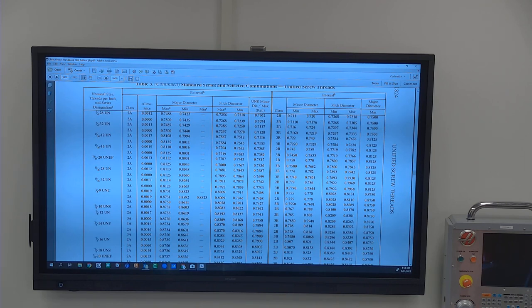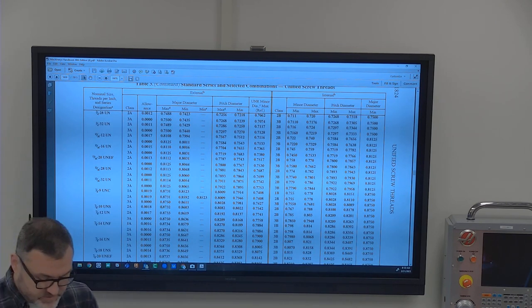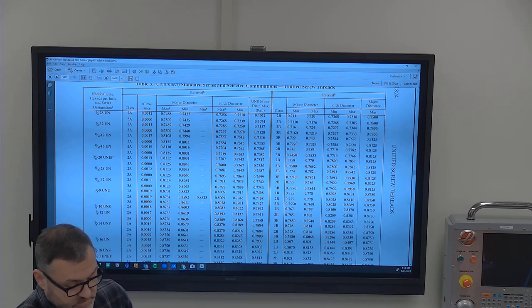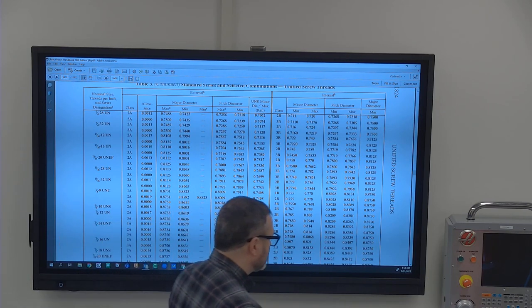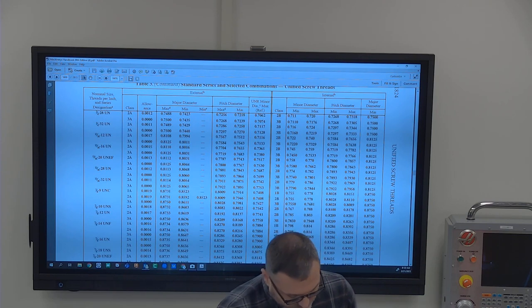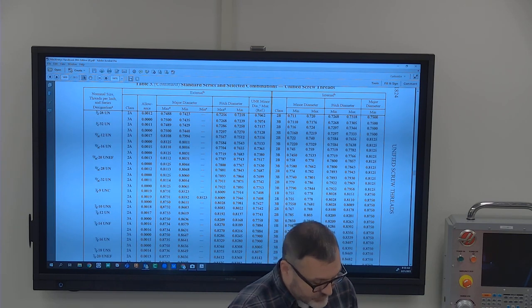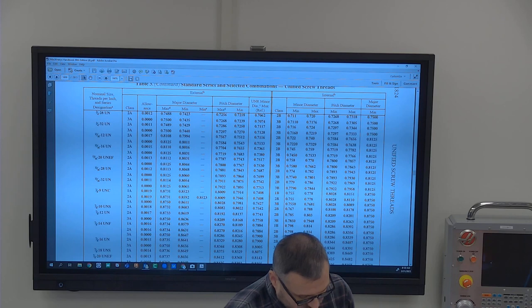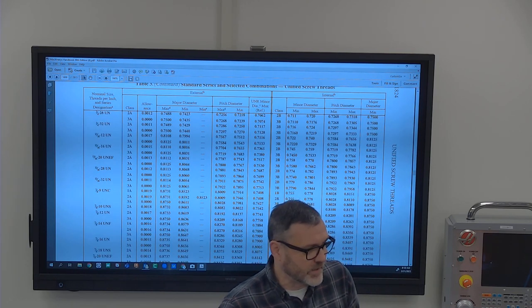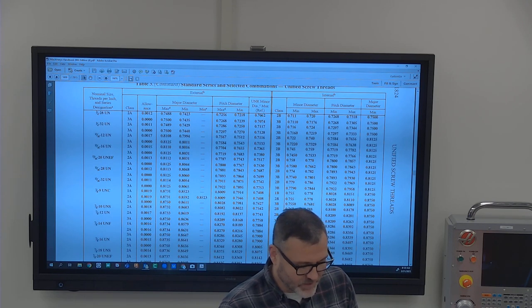Okay, and so then we have also thread micrometers. Thread micrometers is what I showed on the board. You've got the point and then the negative side of it, and we're going to bring that into the grooves. Now, again, every gauge has some subjectivity to it. If I have to pull it off, I'm like, oh man, it won't go that way. Yeah, that's it. Nope, that's not it, right? It's got to go over it.